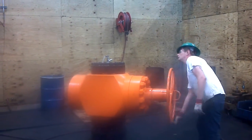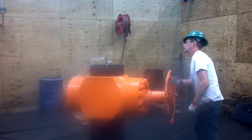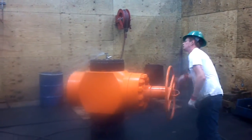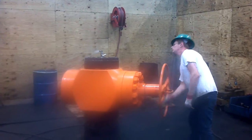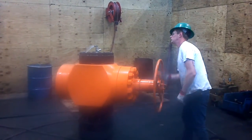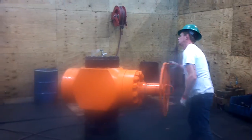With the only pressure he would have on a live well is whatever pressure he's pushing on the packing, like any other normal valve. Now, if you put a ball screw on this bonnet, a 10-year-old boy could open it at 20,000 PSI.